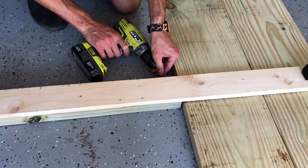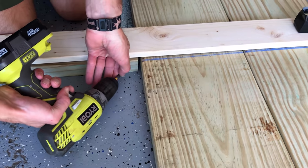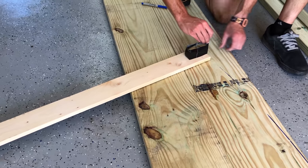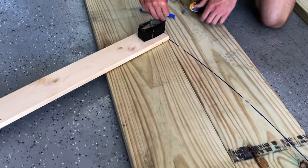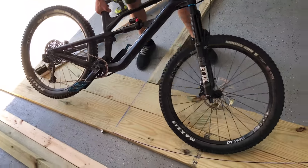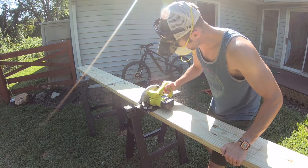Next, I'm going to attach the base piece of wood into the 2x10s — that's just going to hold everything in place temporarily while I make my measurement for the transition. Then I'm just going to draw the curve of the ramp with the sharpie on the end of the piece of wood. This is a really easy way to get a perfect, accurate transition radius. Now for this ramp, 8 feet is going to be pretty steep, but it's not too steep for a mountain bike. If you're going to be hitting the ramp at lower speeds, 8 feet is probably good, but if you want to hit it going really fast, it probably should be a little more mellow — maybe a 9-foot transition radius.